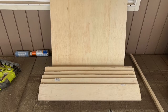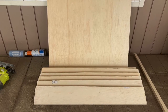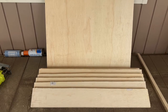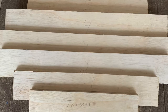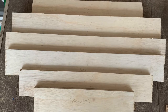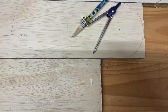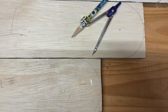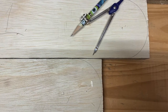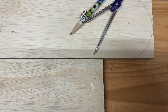Creating a taper of the hull up to the nose just required making the fifth form a little bit smaller than the previous ones. I cut all of the forms out of a single piece of two-foot by four-foot, three-quarter-inch plywood. The initial strips were cut at 3.75 inches wide to indicate the depth of the board. Each form was cut to length and numbered. The board is 28 inches wide at its widest center point. I used a simple compass to describe half circles on the edge for the lateral profile — which turned out to be the first design error, as the curves were a little too tight for the cedar strips.